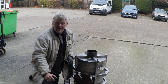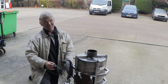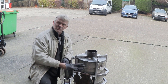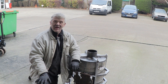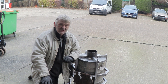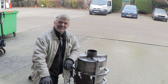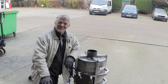I've dismantled everything to give it a chance to cool down. The problem with it is it's producing too much too rapidly — I suppose if you're going to have a problem, that's the kind of problem you want. We tried to connect it to the generator but all we did was lean the pipe up against it, and because it was shooting out so far it wouldn't start. What we need to do is make a proper connection to the generator with its own pipe and try that again. We're producing an awful lot of very clean syngas that burns beautifully from this unit and I'm really pleased about that. I'm going to have to do something about the amount it produces — it's far too much for the little jobs I wanted to do. My thought is to reduce the amount of vacuum. Anyway, there is our home-built gasifier up and running and working. I hope you enjoyed the video — thank you very much for watching.